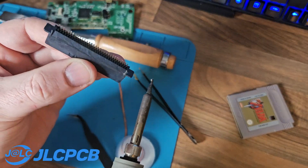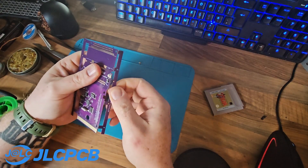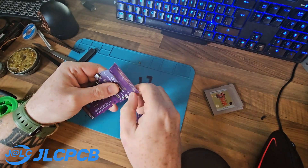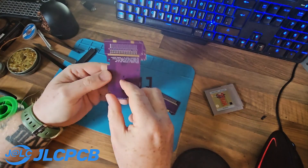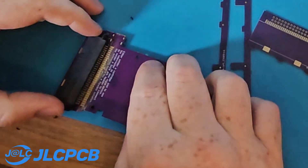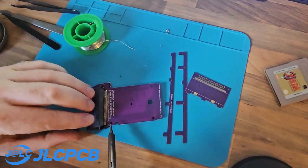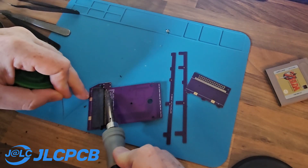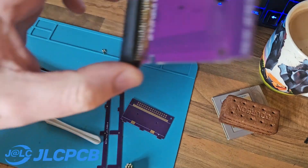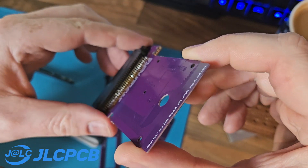Now that the connector is loose, we have to modify it a bit because it's not designed to fit original Game Boy games — it was only meant for Game Boy Advance games. I trimmed off the edge and now it fits absolutely perfectly. I applied loads of flux to the pins, tacked one side and then the other. Somehow in my infinite wisdom I still managed to get it a bit squint, but all the points had connection, everything was strong and sturdy — it still worked.